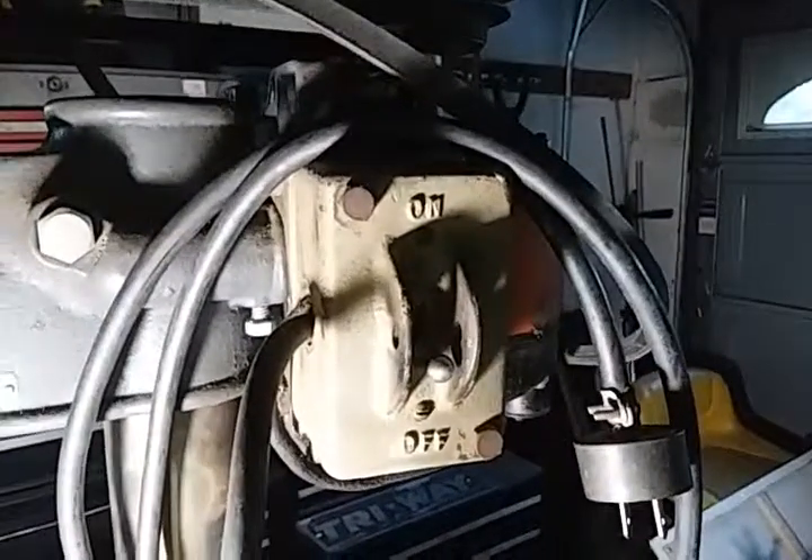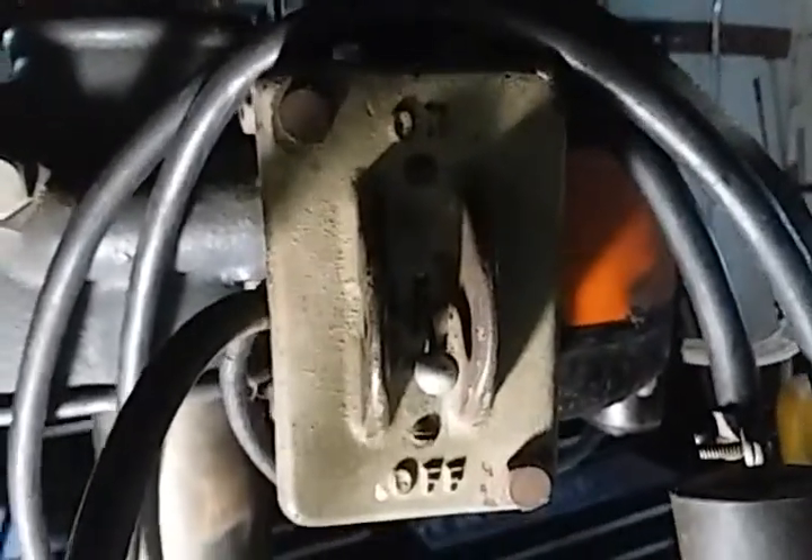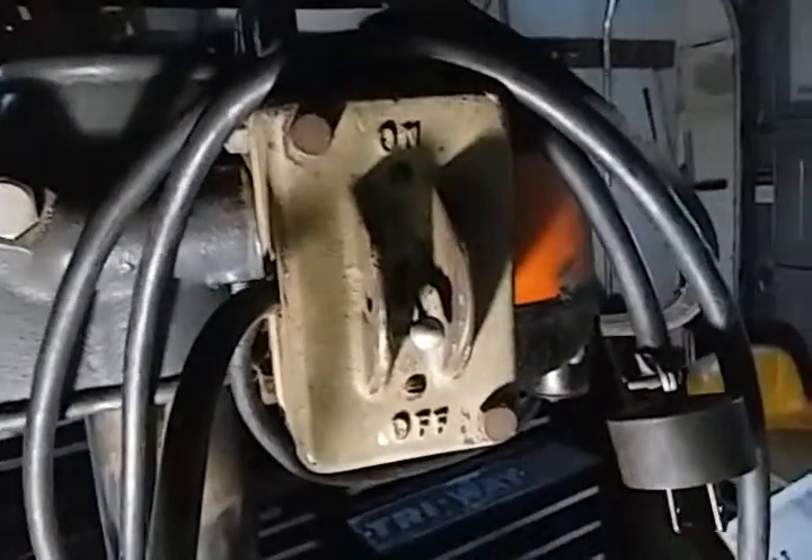I'm basically just going to take it all apart, clean it all up, and paint certain areas on it. I'm just trying to figure out whether or not I'm going to get rid of this box — I don't think it was original. I would imagine they probably had some kind of toggle switch, if not just a direct plug-in. I've just never been a fan of these big boxes; it's overkill. The power cord's kind of janky, so I'm going to replace all the wiring. I'll most likely just fabricate a little steel bracket that'll mount to the motor mount, kind of on the right side, and put a toggle switch right to that.